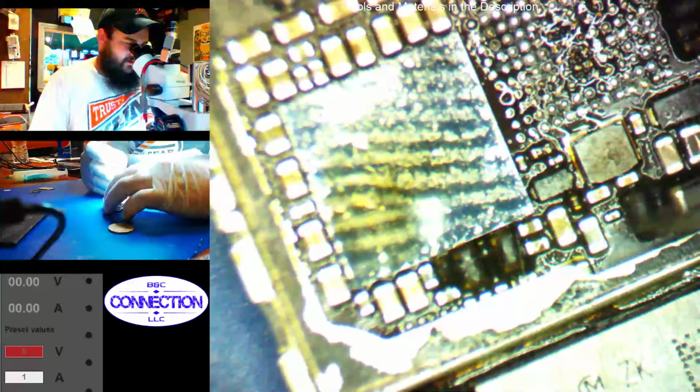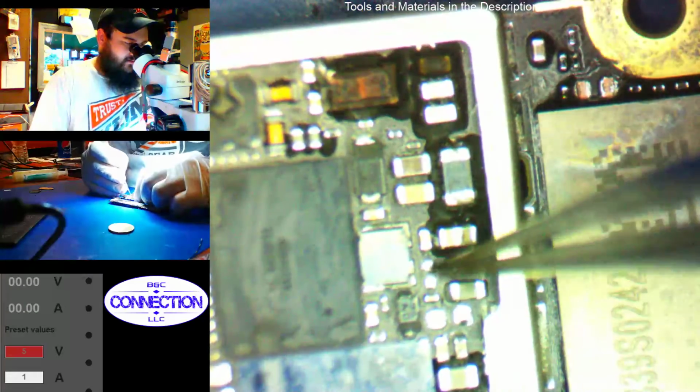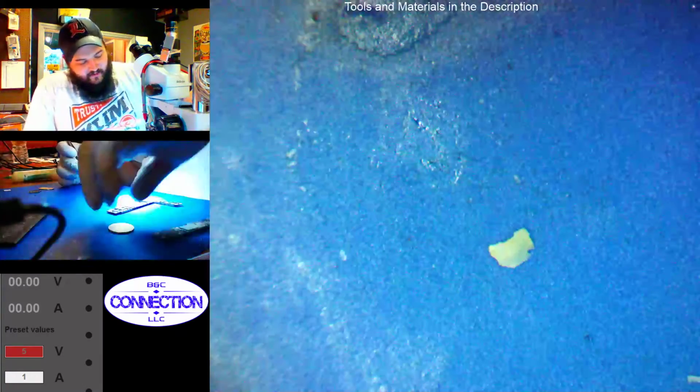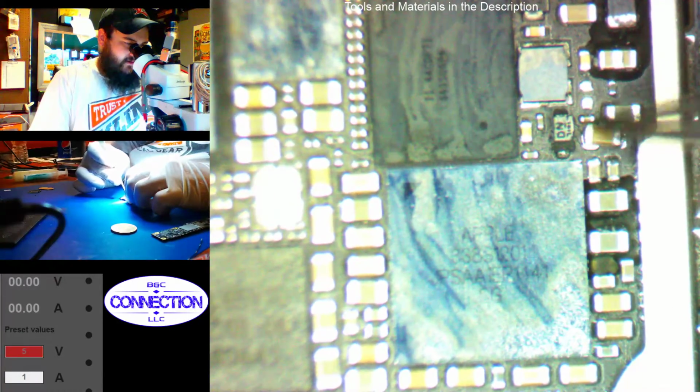Alright, so we need this cap and that one. So you and you, I think. No, you. Is that right? Yeah. Okay. Need you and you. So let's take these off. Tip, if you grab your cap ends, they'll come off faster because you're transferring heat through your tweezers than sitting there hoping the air will transfer the heat for you. So I'll drop my cap in there. Drop my other cap in here.